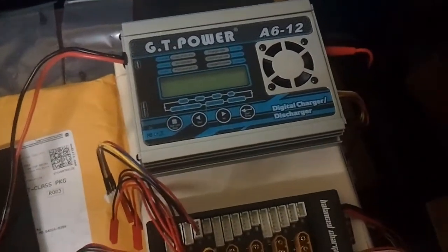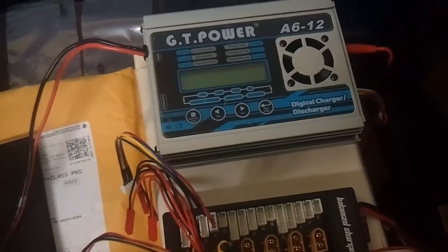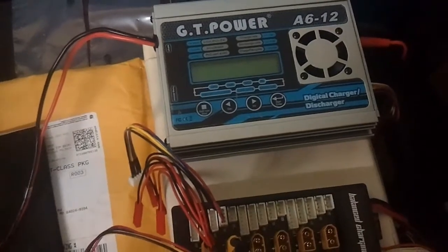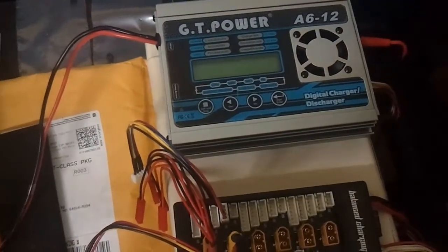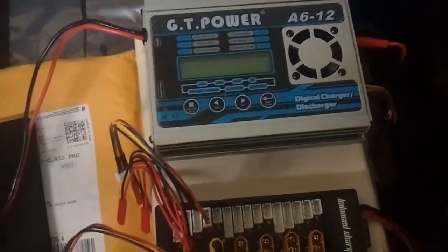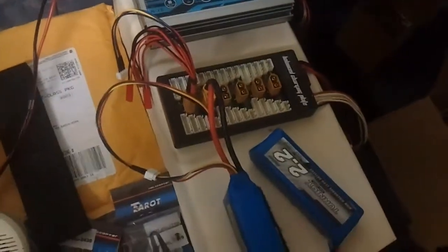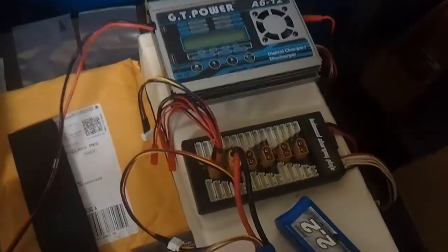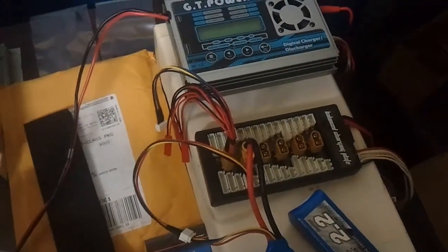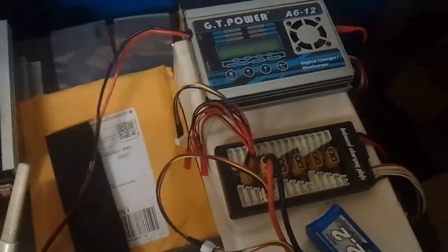Now there's more of a problem. In the last video, I showed a charge cycle approaching 120 minutes. About an hour into the charge, the milliamps did not change, amperage was at zero, and the cells were not done — it was still trying to charge but nothing was going in. When it timed out, I went back in to try to top off one of the LiPo's again, and now I get zero amps of charge no matter what I choose, and no milliamps going into the pack at all.